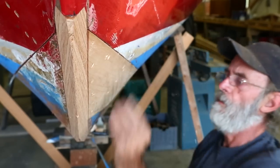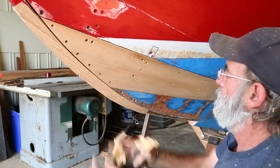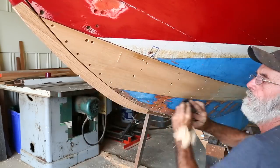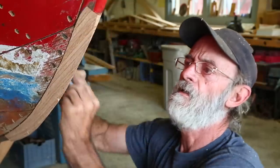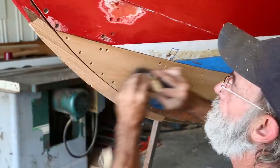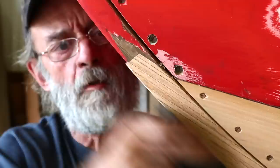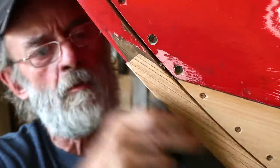The enemy with a block plane is getting it chattering. If you have your hand too far at the back of the plane it will chatter, so you keep your hand up on top of the plane and it really does a nice job. Of course the plane has to be very sharp. I'm using it to get the shape exactly right, using the planking as a guide, and once I've got that accomplished I'm going to switch over and start planing the profile with the same block plane.